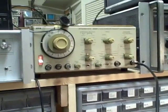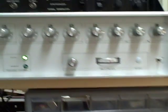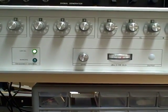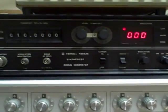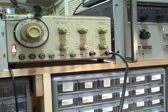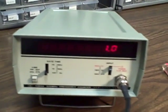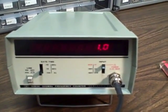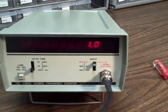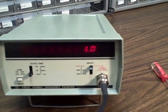So by golly, that was off of our Interstate generator from about 100,000 hertz down, we were on the PTS synthesizer from 100,000 hertz up to about 10 megahertz, and then we were on the Farnell from 10 up to 520 megahertz — those two are synthesizers, they nail it right on. The Interstate is a more standard oscillator type. So this thing is dead on from the synthesizers, and we are getting good readings down to a hertz.